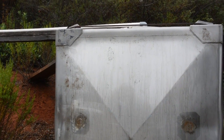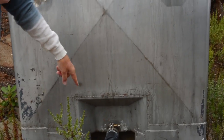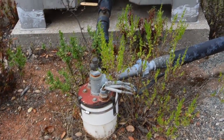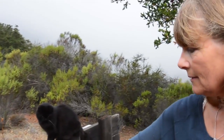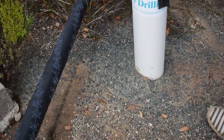So from here, the water pours in, and at the point where this tank is about half full, we open up the line. And we have a pumping system on this side that turns the switch, and the pump is housed in storage here in a containment area. And so the minute we turn the pump on, it feeds through this line here and runs all the way up the line to the very top of the mountain. And when we dug our second well, the second well is right here. And this is the actual pump and housing from that well, but the whole line and infrastructure to go up to the top was here. That's why we set the pumping station here.